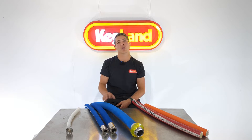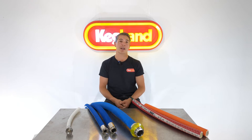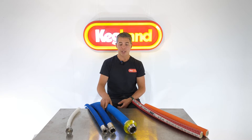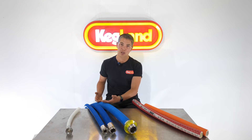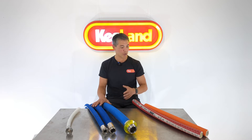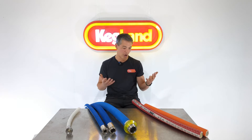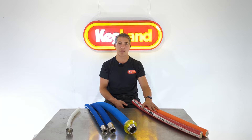If you've got a brand new EPDM hose, you must run it through a hot rinse cycle a couple of times. If you've got hot caustic wash for washing the tanks out, I'd highly recommend running that through the hose twice to blow off a lot of that aroma. Once you've done that they're perfectly fine — the aroma will eventually blow off and disappear as the hose continues to cure. After some time it'll have just no aroma, just like butyl rubber. If you want to get a hose straight off the shelf and use it straight away, maybe butyl rubber is the best one for you.